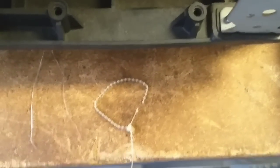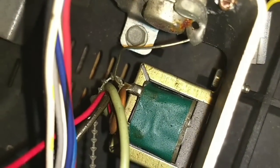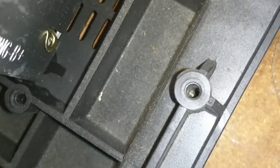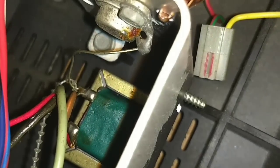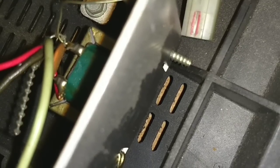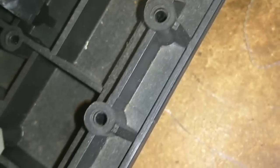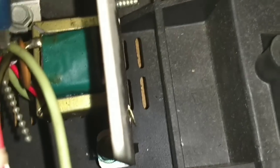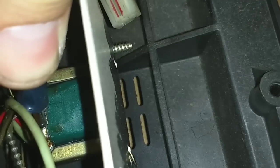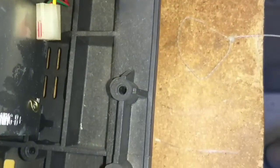The next thing we have to look at is the resistance of the primary of this little transformer down here. You can see they've got that in series with the collector of the transistor. There's something interesting: if I go between chassis ground and the heatsink with my ohm meter, we can hear crackling in the speaker. That tells me very likely this transformer is alive. In fact, if I connect it down here to this terminal, you can hear the current of my ohm meter going through the transformer. So the primary of the transformer is alive, and the little transistor is alive.